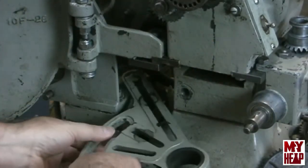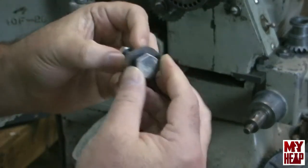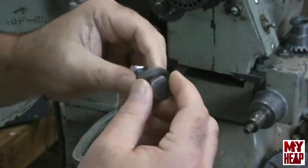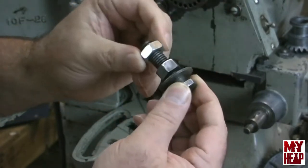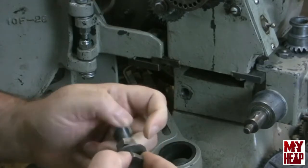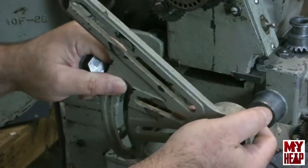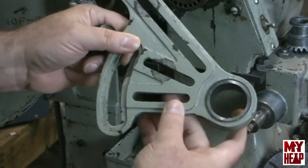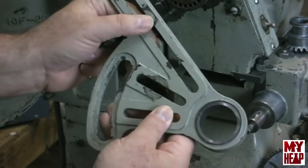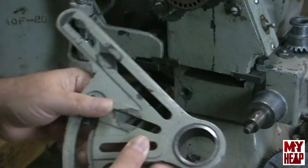The banjo has a bolt that runs through it. I have the bolt in my parts bowl — it looks like a regular bolt with a very narrow head. I cleaned up some burrs on it, and there's a washer and a nut. What I was missing was a jam nut. When you assemble this, it's important you don't have any lateral twist on the banjo, because it's a relatively thin cast iron casting — brittle — and you could crack it. I've seen videos where people had to braze their banjos back together.